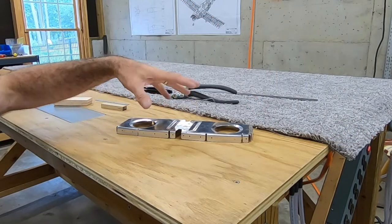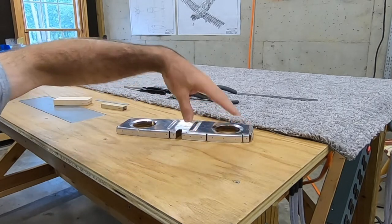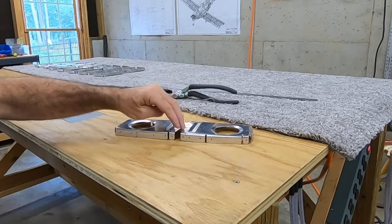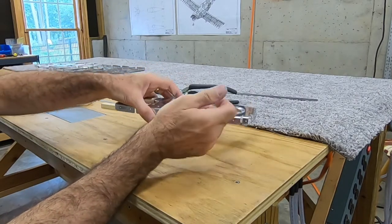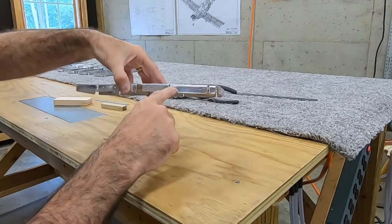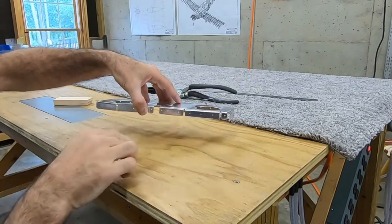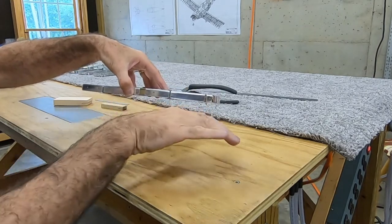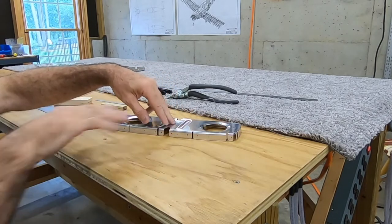Hopefully you can see on the camera that when I lay this flat on the table with the flanges down, it's not quite flat — the rib bows up in the center. I'm not too worried about that because this part is pretty easily bent and will form right into shape when it's riveted in place in the skin. But these areas where the flanges were formed get stretched and put a curve in, so I need to come back in and flute between these holes to tighten this up and take that curve out.